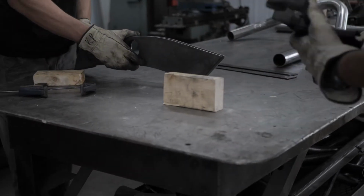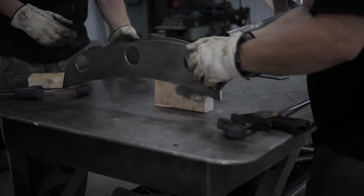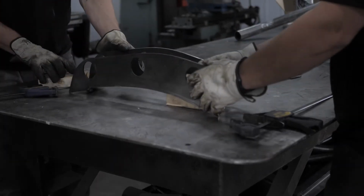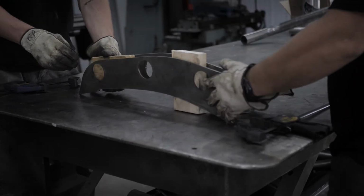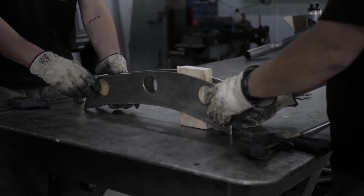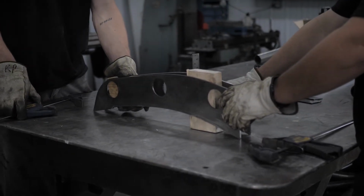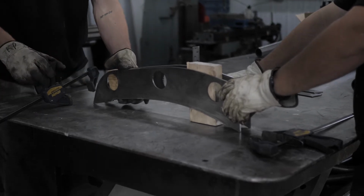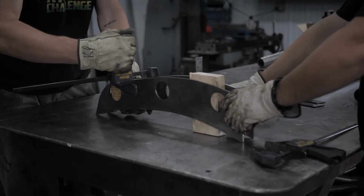To assemble your uprights, it is suggested to use a 2x4 board to space the inner/outer hole protrusion plates 1.5 inches apart inside to inside. Then you will tack and wrap the flat strap across the face of the upright.